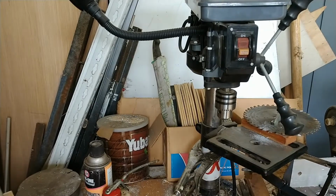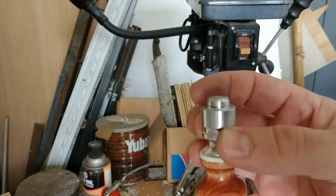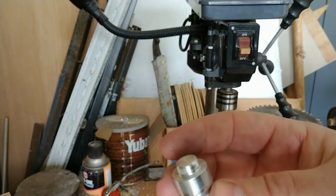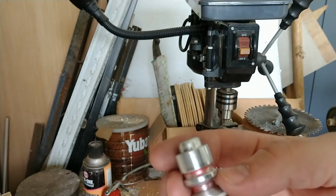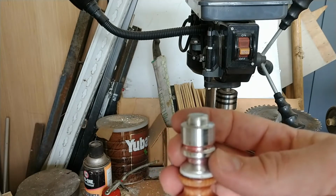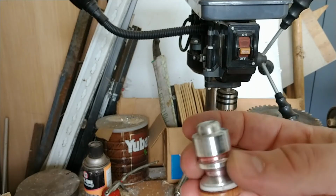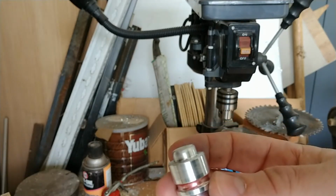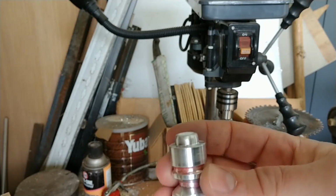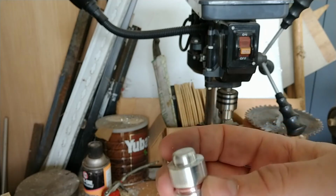These are kind of an interesting mold because it's almost hard to get the core pin to cool enough to not be sweating when the slug is solidified. So it's sort of the opposite of most hollow point or hollow base molds where you're struggling to keep the core pin hot. With these, you have to just let it cool longer than you otherwise would. So it's not a high production mold, it's a high quality projectile mold.